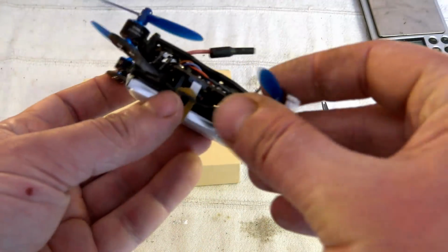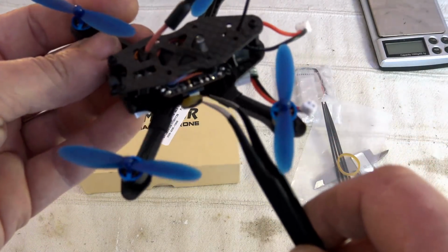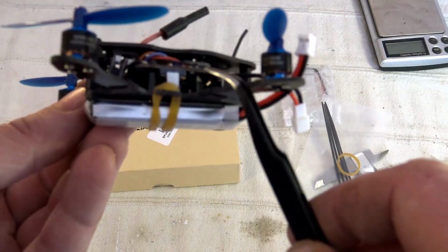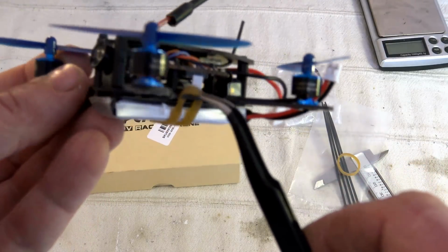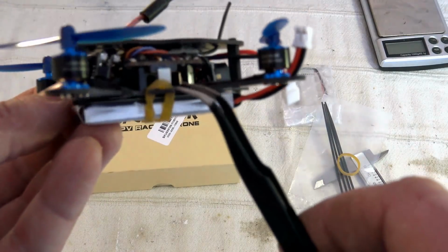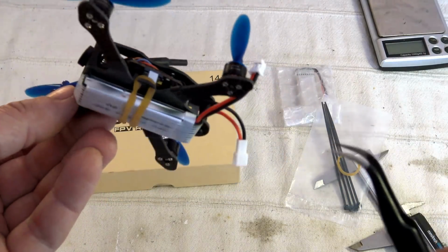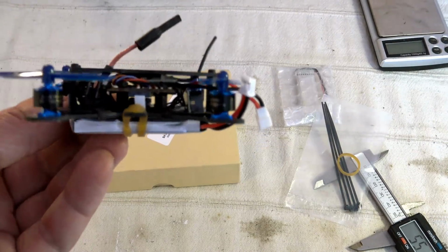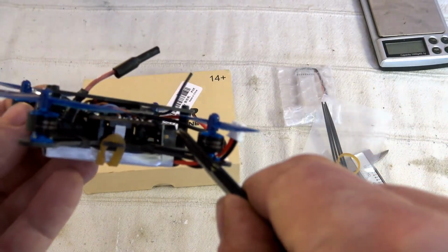So let's discover a little bit the F3 board here, a large one, and you can see we have a ribbon cable for connecting the flight controller to the IMU, and the IMU is dampened. So maybe for angle mode, 6-axis stabilized, we won't suffer from any drift. Okay, but at least it's a good point. On the rear side, we have the battery.